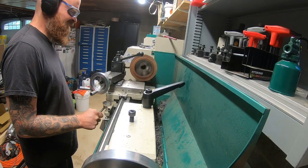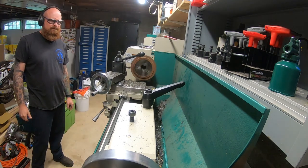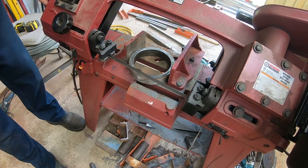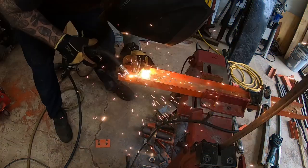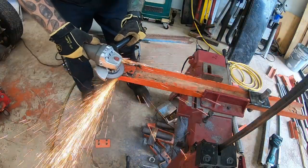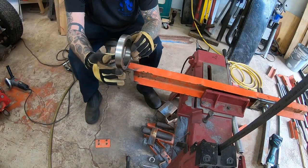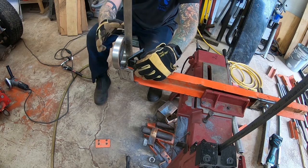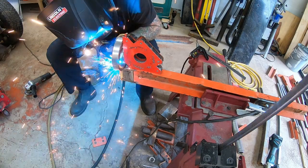Since I started thinking about building a firewood processor, the hourglass rollers is one of the things I thought about a lot. I decided to make one at least for the log clamp, that way if I ran the infeed with the log clamp down, it would likely let the log move instead of bending anything or messing anything up. I had these basically pulleys that cables went through or around — steel cables that had bearings in them — so I figured that was a good foundation for building a roller.